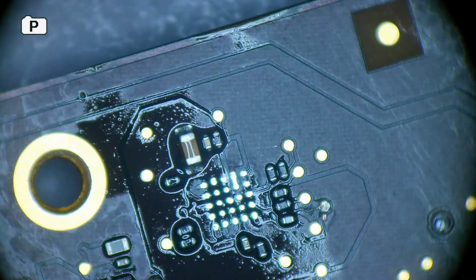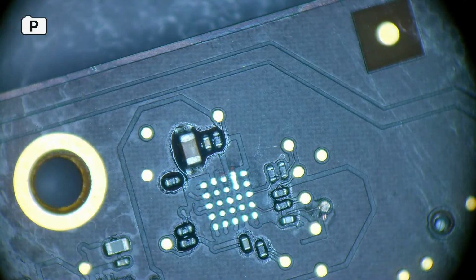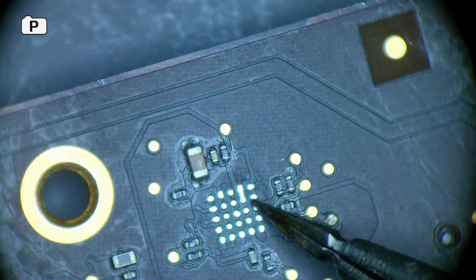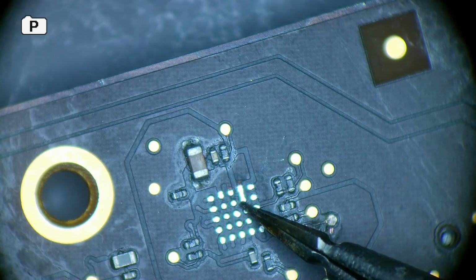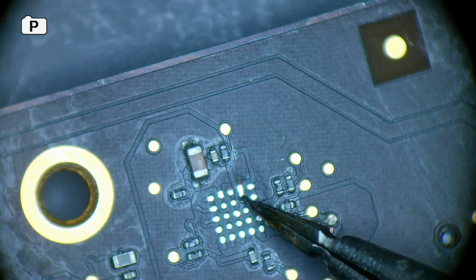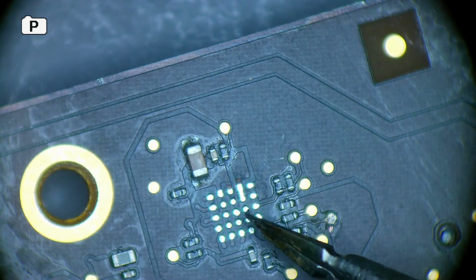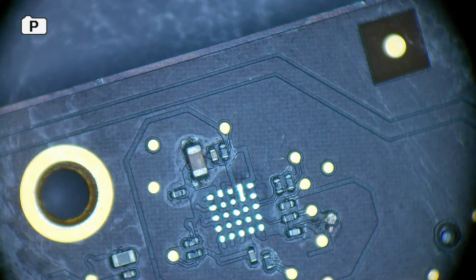So pads look good. If you're wondering about this here, these pads obviously connect, and it's gotten rid of the coating in the middle with the soldering, using the wick on it. And the corrosion itself obviously made it very brittle. It's no problem, that can stay as it is, because these two do connect anyway.